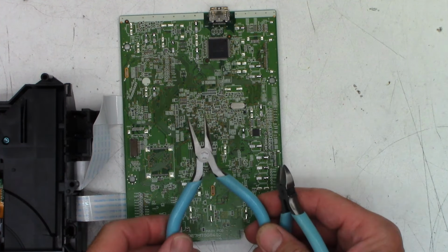And then we're just going to add a very, very light downward pressure to the lens. And you want to go in circular motions only. And I'm rotating the cotton swab. You see the cat hair stuck to it right there. Barely putting any pressure on the lens itself. Now to the dry end, the same thing. Very light downward pressure. Circular motions only. And rotating the cotton swab at the same time. Well, I think that looks better. With the flashlight, it looks absolutely spotless. I don't see any specks of dust on here whatsoever.